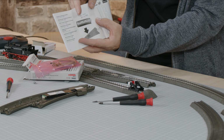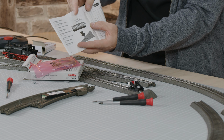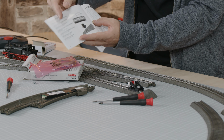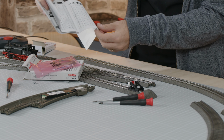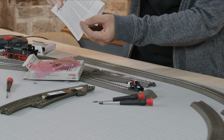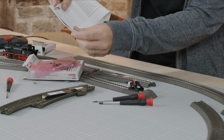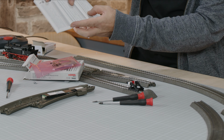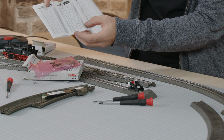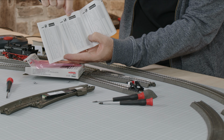Because here there's a little mouse piano, also called a DIP switch. Depending on its setting, the turnout has the address 1, 2, 3, 4, 5, 6, 7, 8, and so on. And if you now have a turnout with the number, what do we have here? Really? 511 goes up that far, okay, at DCC. So, there are two different protocols, and in the MM protocol, I believe there are a bit fewer. Then, you can set many different addresses here, and then at the top is always this position of this turnout.